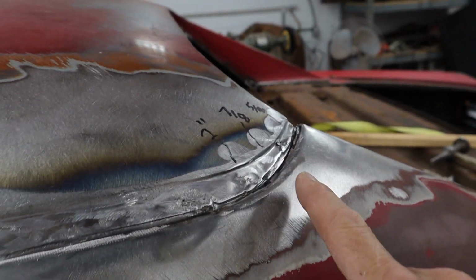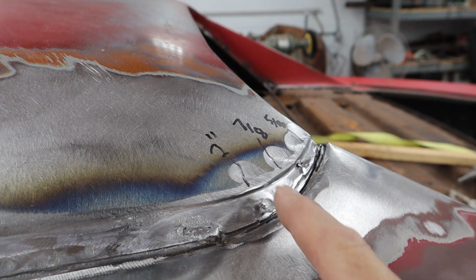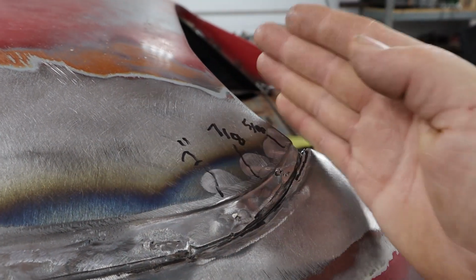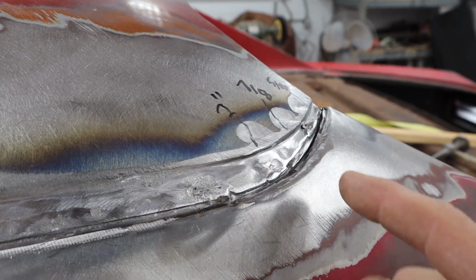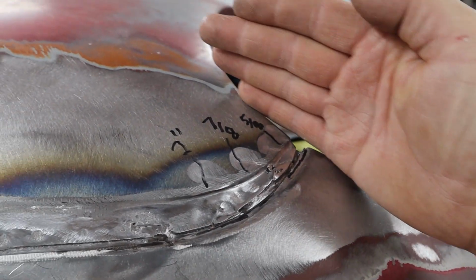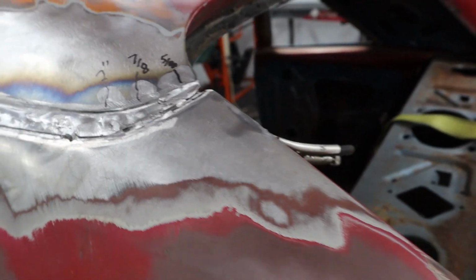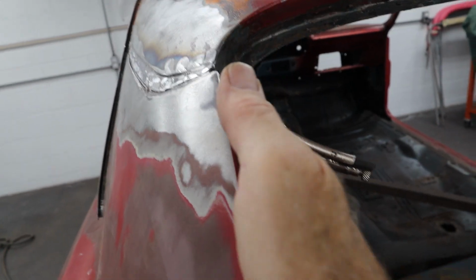And you can see right here, see these little circles right here? Those are some dimensions from when I was doing trimming, but those are dents right there, and they're like little tomahawk chops. What happened was I think that was too high before they leaded it, and they just took a hammer and wham, wham, wham, and just put leading over the top of it. So our line right here is looking really good. That looks really nice. And around over here on this side, right where the window sits, that's all looking really nice too. So I'm pretty happy about that.